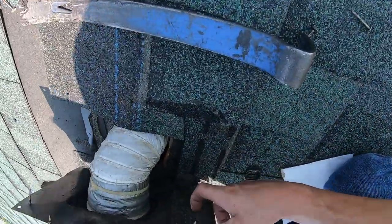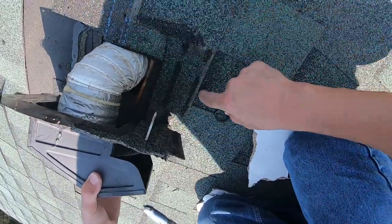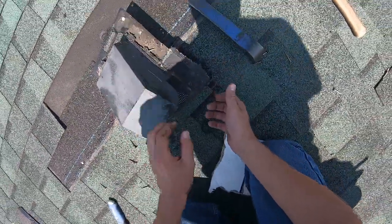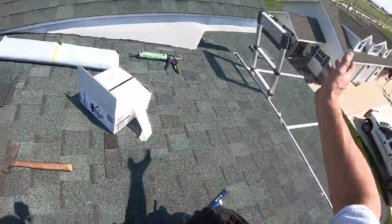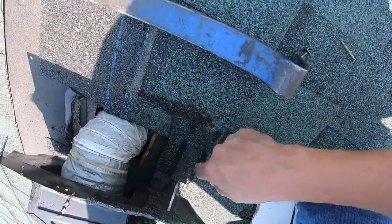It's a good spot to point out wind-driven rain. See the distance you have from here at the bottom of the flange to here? A lot of guys say don't ever nail your bottom down. Well, if it rides up and you get rain blowing in that direction, pushing wind-driven rain up under there, you've got that much room before it drops in.